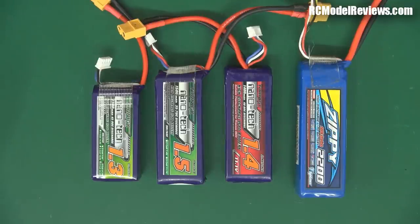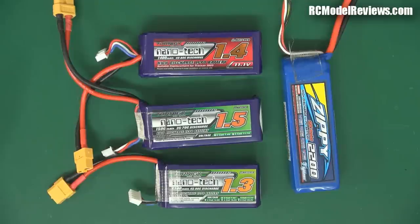Let's talk about how to look after your batteries, because one of the things that makes me cry is I see people buy new batteries, come out and fly for a couple of weekends, and then about a month down the track their battery alarm's going off or they're not getting the flight times out of their batteries. Why have their batteries failed so early? Usually the reason is bad battery management. It's so tempting when you're flying to just keep flying until it won't fly anymore, and that will be the quickest way to ruin your batteries. If you take your batteries down to dead flat every time, they're not going to last long - maybe a dozen cycles before you really notice they just don't have any punch anymore.